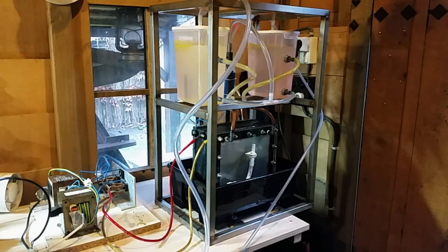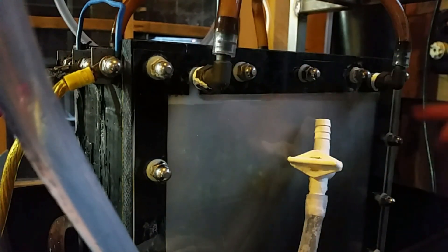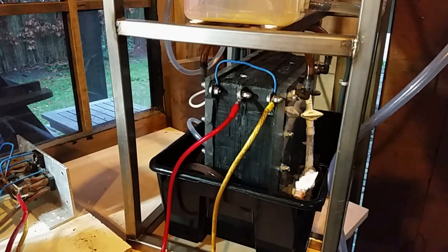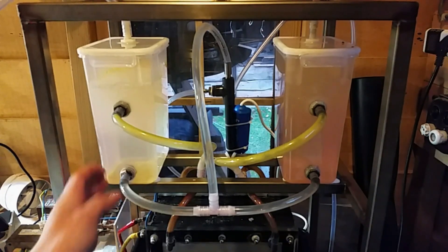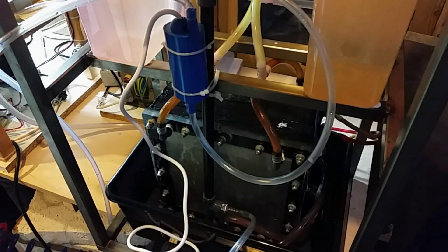So then I made this — it's called a dry cell. It has 11 plates. I made the outside transparent so you can see the gas flowing through. This side is the hydrogen side and this side is the oxygen side. You can see there's no gas going through the oxygen side. I coated it to make it watertight, because water can leak out through the felt. The containers on top are the reservoirs, and the water circulates through the generator, pushed up by the rising bubbles. This generator still generates a little heat — the temperature rises about 15 degrees Celsius in 4 hours. After a while the water gives off quite an amount of water vapor, which we don't need, and because the water is still very alkaline it ruins the compressor after a while.